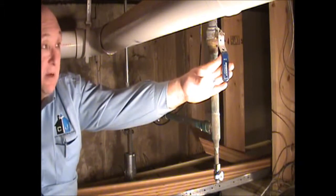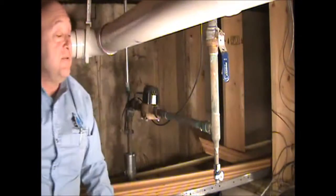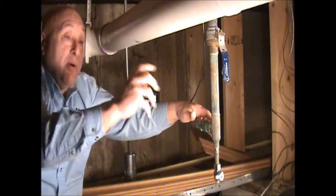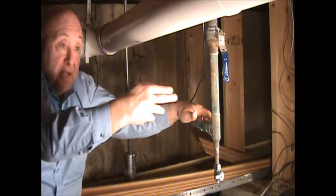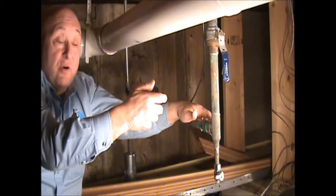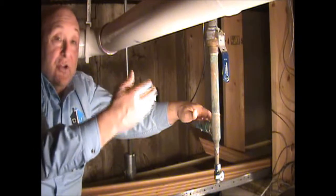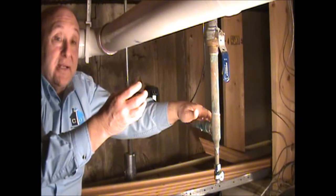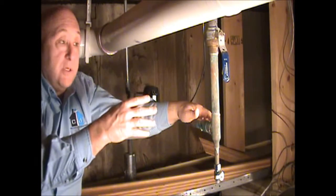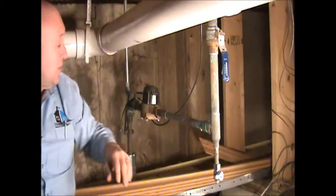Some homes won't have these ball valves — which have a stainless steel ball inside with a lever — they'll have the screw-type gate valves. When turning gate valves on, do the same thing: a little bit at a time. When you turn them on, the stem comes all the way out; only turn it one or one-and-a-half turns. Don't leave the gate seated all the way up inside, because sediment can attach to it and prevent it from closing completely over the years. Ball valves have a different mechanism inside — you can leave those wide open.